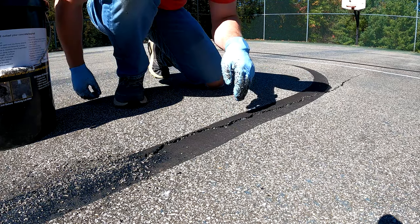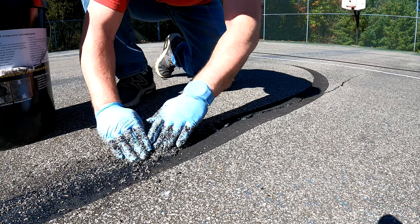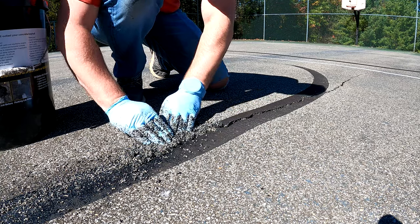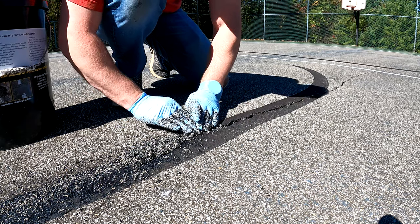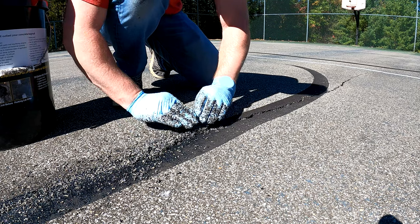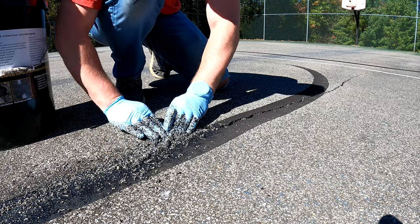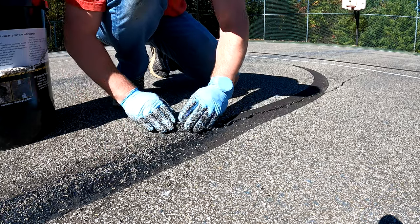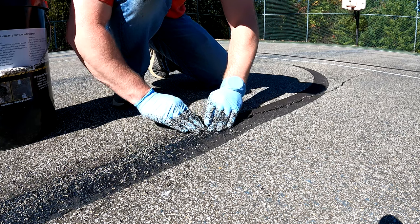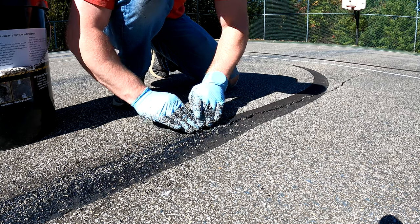This part is really cool — here's a crack I haven't put sand in, and it's three or four inches deep. What's great is I can put the epoxy mix in and it will slide down, but if you keep going it actually stacks up on the side and starts to grab hold. As you press in more and more, the epoxy sand grabs the wall on the inside. I found my hands are much better at this than the trowel for small stuff — I can get it to stack up an inch or more deep along the wall. For a crack about a quarter inch wide, that's about the right width to do this.